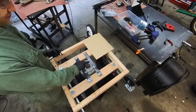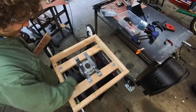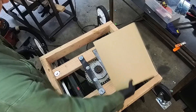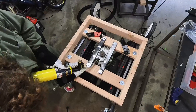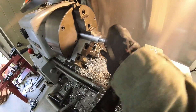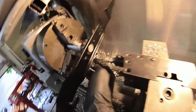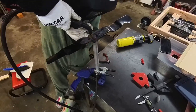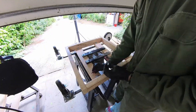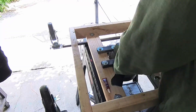We're going to remove the sprocket, mount it, and weld the blade to it. Also need to come up with some sort of deck so you're not just throwing debris — it would be kind of cool to have a window somewhere. That red Loctite on these set screws is great. The lawnmower blade and the sprocket both have a 7/8 shaft, so I'm going to use it as a guide to weld the blade on. It fits quite nicely. Time to add some Loctite and get everything set and secure — just sand the shaft a bit so it goes on smooth.